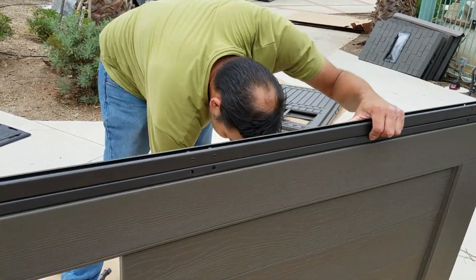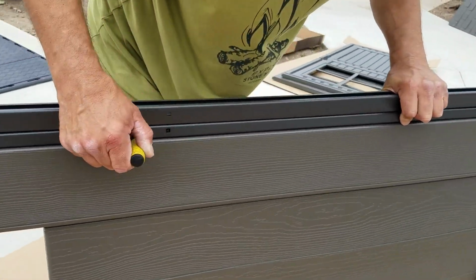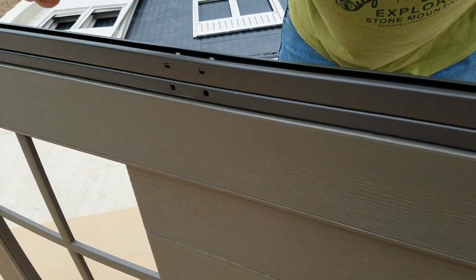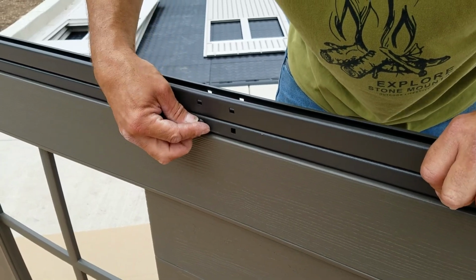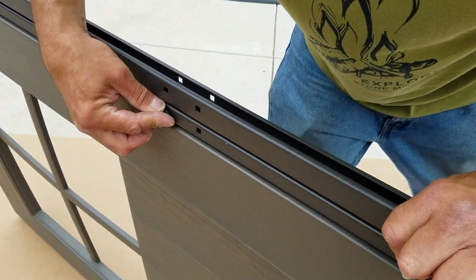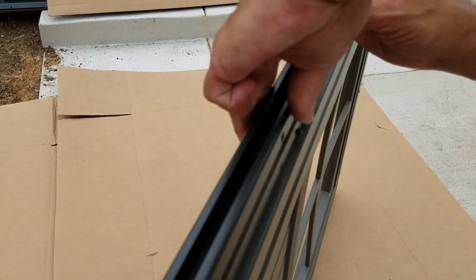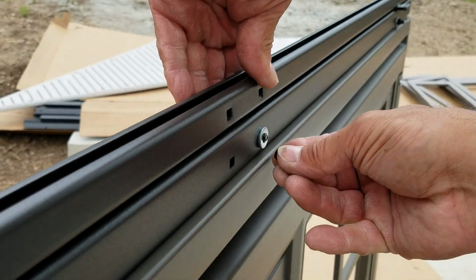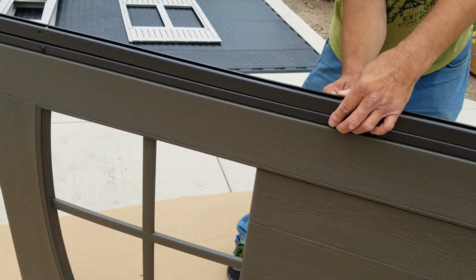Then you go to the middle section, run 2 in there. I'm clearing the holes. I'm just doing that circular motion through each hole like a square. All 4 corners, it bumps around all 4 corners, and it helps line up these carriage bolts to sink through that little square shape and down out the other side, so you can put your washer and the cap nut on top of it. And I'm just hand tightening them all, of course, for now.